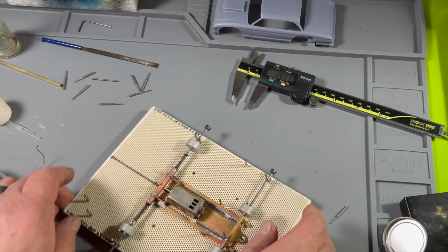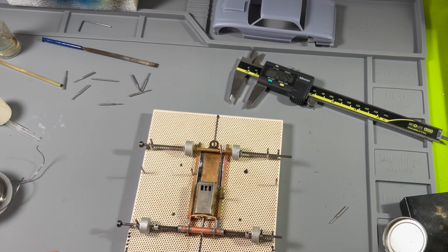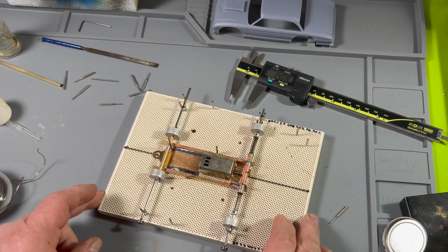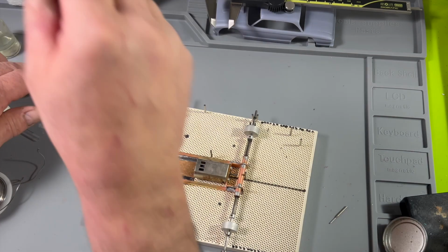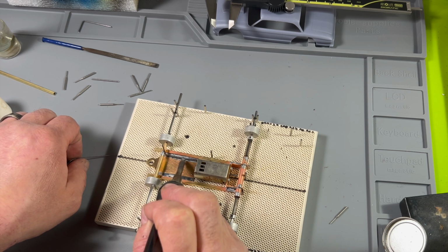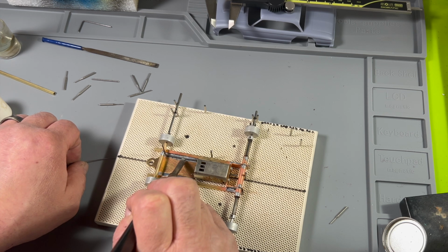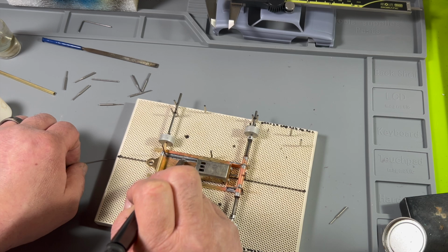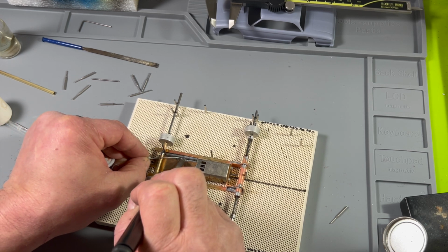And I'm going to solder the rest of this wire right here. All right, keep moving this around like a dummy. I'm going to solder that wire there, and I'm going to get flux again right through there. Get my soldering iron. Let this get hot. Like I said, that's where you've got to be patient with this, because you've got solder from where you soldered the guide tongue on. Just going to let everything get hot. It takes a little time. You've got to be really patient with this. Add some more solder right there if you want.